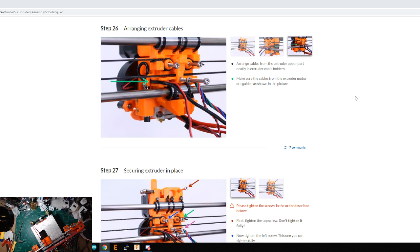Yeah, my PETG, I can't remember what my bed setting is, but with the PEI, PEI can actually make PETG stick too well. It will actually fuse to the bed if you're not careful, if you smoosh it too much. So for PETG, Rob, I use Eryone, definitely. Eryone from Amazon is my favorite. This stuff is Eryone Orange from Amazon. It sticks really well to PEI.